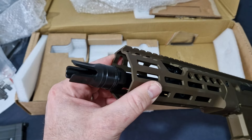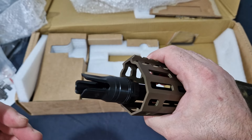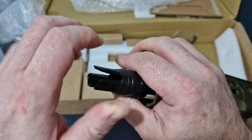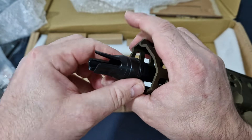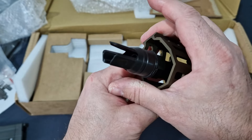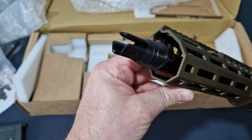If you don't know how to undo it, just watch my upgrade video — towards the end of reassembly you'll see how I put things back together, so just reverse it. Hold the base nut with a pair of vice grips and twist off the three prongs clockwise — those come off first — then take off the base nut counterclockwise. Just make sure there's no grub screw in there, because some have been drilled with one, some haven't.